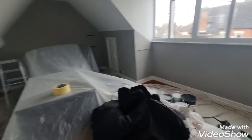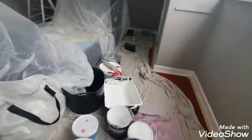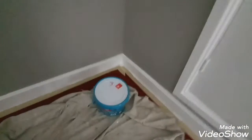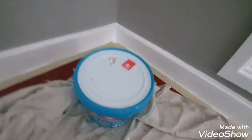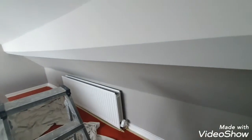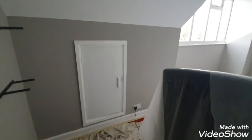That's the Tickerilla system: the Otex Aqua as your first coat, and then two coats of Evo Aqua 40. The 40 is the satin, the 10 is the eggshell, and the 80 is the gloss — that's the sheen level. With any water base it's not 100%, but yeah, that's it for now. Thank you for watching — please subscribe and hit the like button.